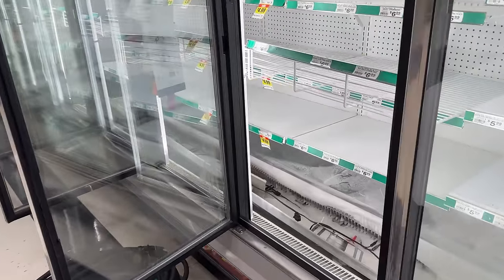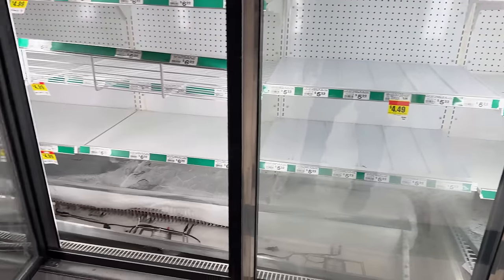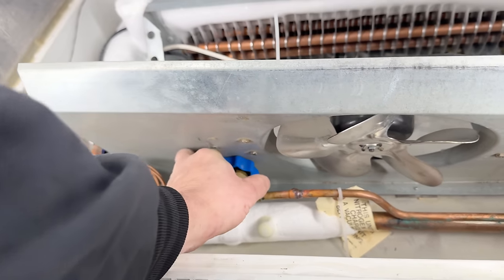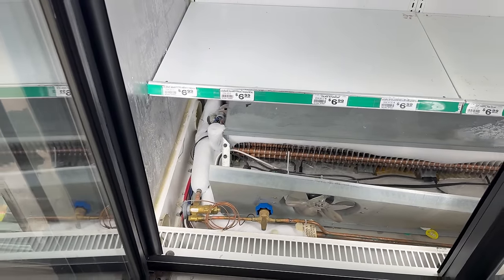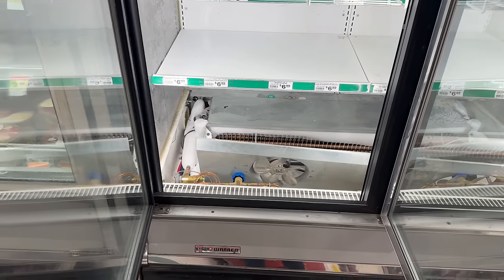I left that on them — I had them pull this here. Heat will build up. I told them it's a possibility it might get warm over there, but you roll the dice on your own product. I told the store manager and they made that decision not to pull it. So the hand valve is open there. There's a lot of freezing up going on behind the TXV — may possibly need to check the screen. Most of these stores have dirty systems and screens get plugged up quite often.